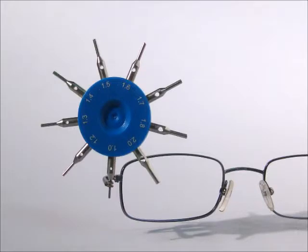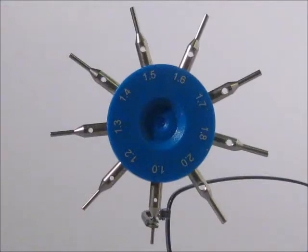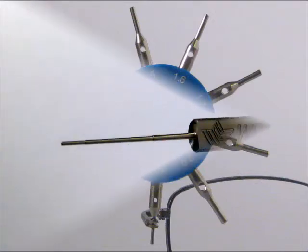The old-fashioned screw gauge measures the size of the barrel but does not consider the added dimension of the screw threads. A 1.2 millimeter hole does not use a 1.2 millimeter replacement screw, so it gives you only a rough starting point.